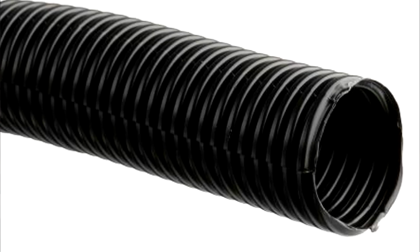So if you're going through a vulnerable area, for example, through a side step, I'd try and put a bit of flexible conduit around that, or even solid conduit if you can make it work. Just that vulnerable area, because you only have single core, single insulated cable going through there, and it's easy to break that insulation should it be on a wear point or on a locating dowel of that step.